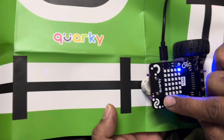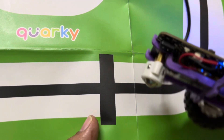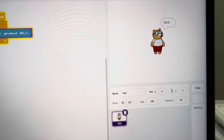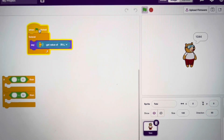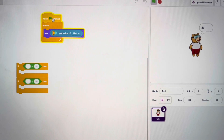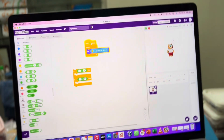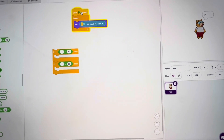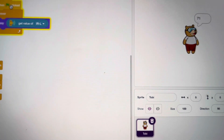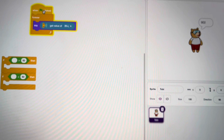This is the left-hand side sensor. I'll move it towards the black line to calibrate it — the reading changes and goes above 100, sometimes more than 1000. Now when I change back to white, the reading is low. This sensor works on negative logic: when it receives more light it shows a lesser reading, and when it receives less light the reading goes high — it is an inversion of value we have to account for while programming our line follower.